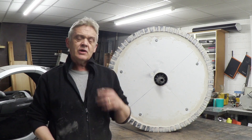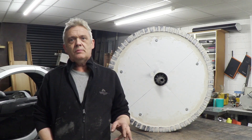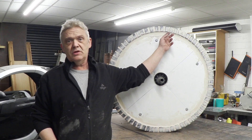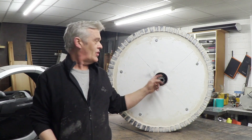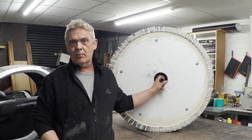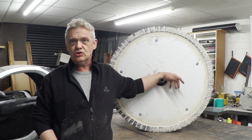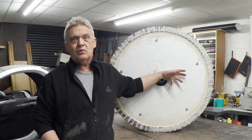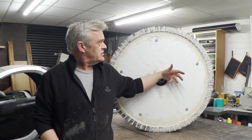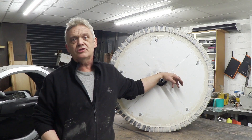So we want a direct comparison. I'm taken up with the idea that there are two approaches to this: you can put something on the axle, in which case you need high torque, or you can put something on the rim of a big wheel, in which case you need low torque. Because low torque and high speed at the rim is equal to high torque and low speed at an axle. So I'm not going to be attaching anything to the axle - no motor, no gearing. The aim is a budget build that takes advantage of low torque and high speed, competing with a one kilowatt commercial generator.